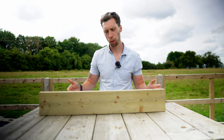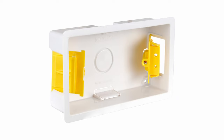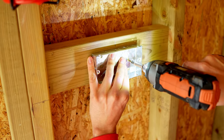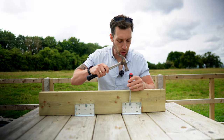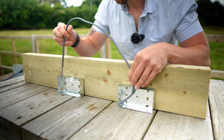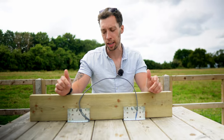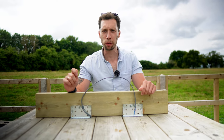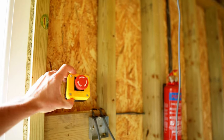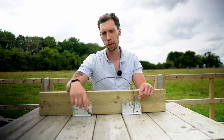This piece of wood here is going to represent our wall. For my workshop I've decided to use metal back boxes — you can also use dry lining back boxes, but personally I'm not the biggest fan. You fix these to the wall using wood screws, then knock out the two pieces of metal on the top using something long and pointy and a hammer, to give you somewhere to feed the cable in. The cable thickness typically used is two and a half mil for sockets, but I recommend speaking to an electrician to confirm your requirements. For example, I'm setting up my workshop with a stop button that cancels power to every socket, which meant I needed to install all sockets with four mil twin and earth cable.